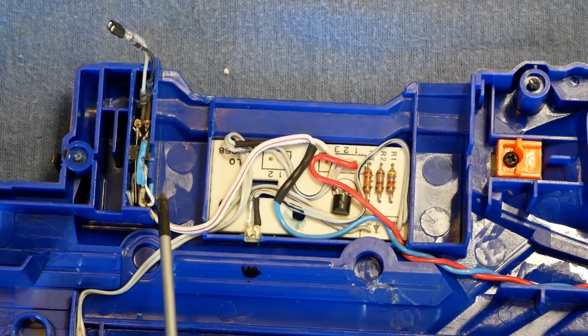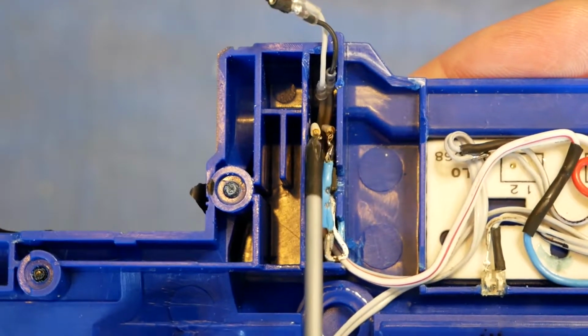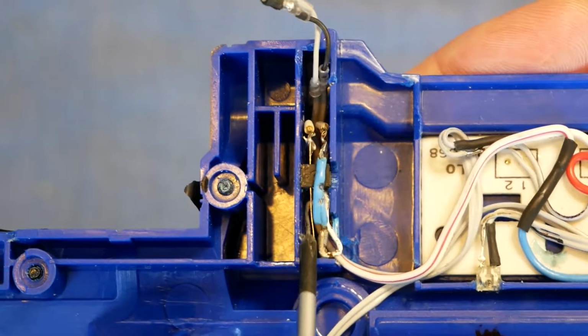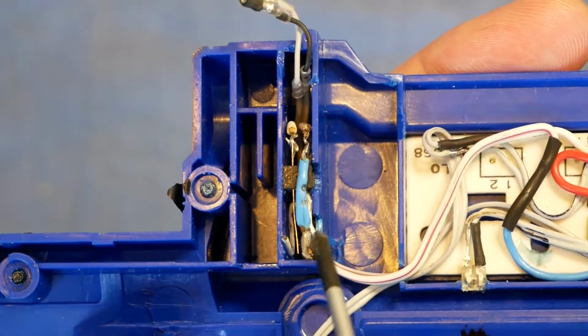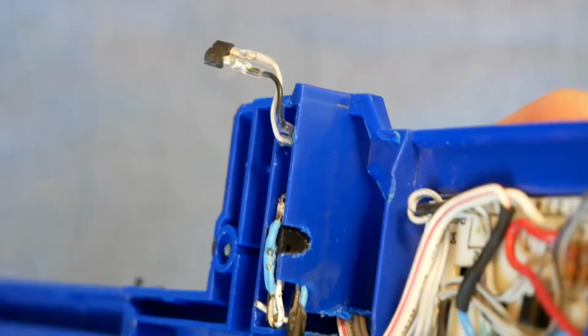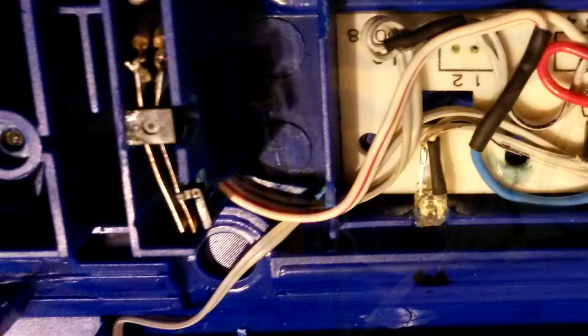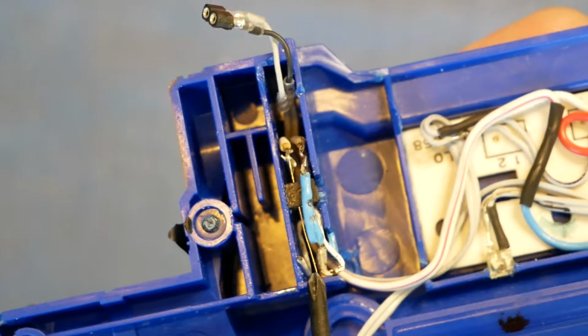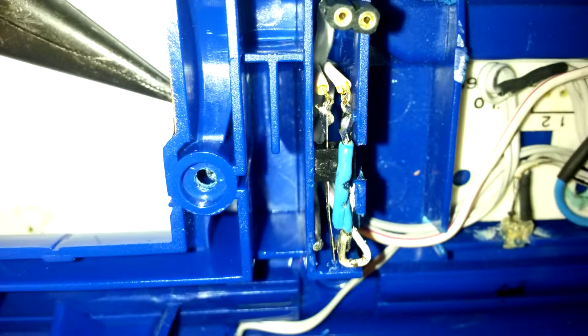I put a little switch in here. So the very first version used this little leaf spring that you can see underneath. There's a little thin bit of metal there, and then under this there's another one. There's a little plastic knob which kicked out into this area, so when the magazine came sliding past, it pushed that into there and they touched. It was just too flimsy and broke pretty quickly. So then I got some old wire. It was actually the spiral binding of a spiral bound notepad, and I bent it to a pretty little shape. Fits just in there, and now when the magazine comes past, it pushes that over.